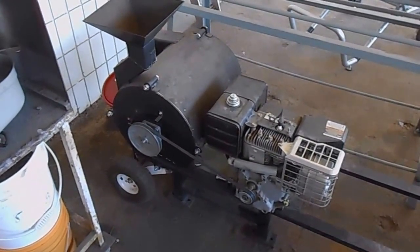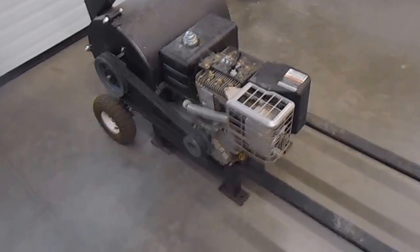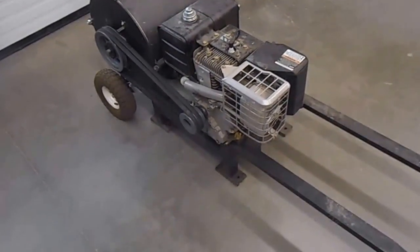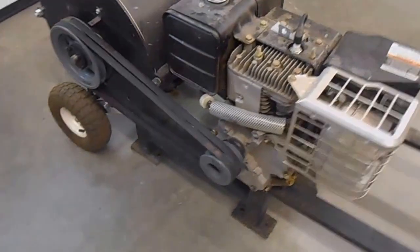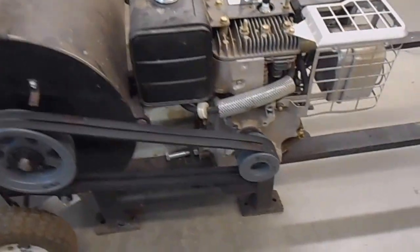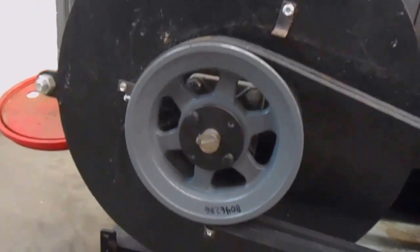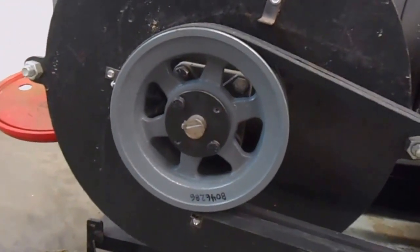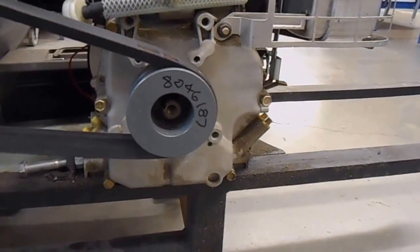Here I've got the pulleys and belts put back on. You can see it's a double belt now — double pulley, double belt — and the B-size belt rather than the A, so they're much more skookum. They're attached on nicely. These are using a different type of pulley where you have a tapered sleeve that goes inside, bolts on, and attaches to the shaft.